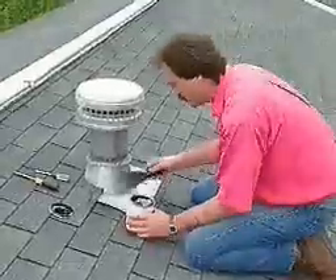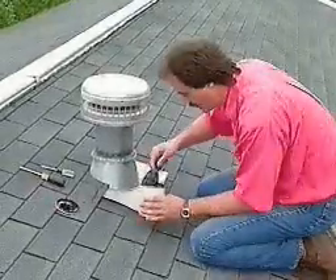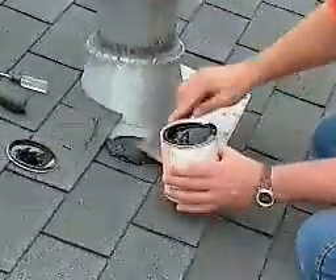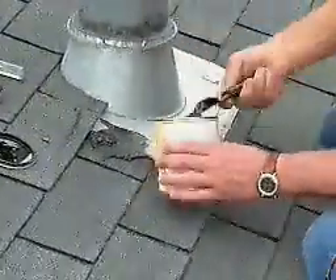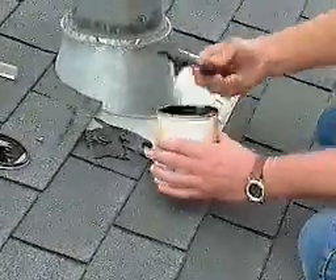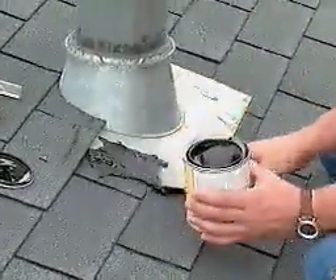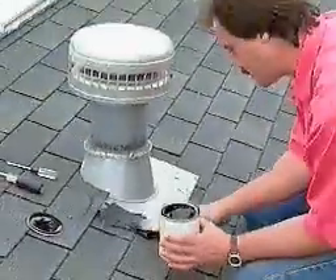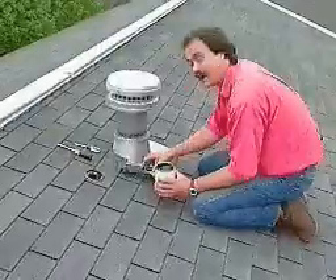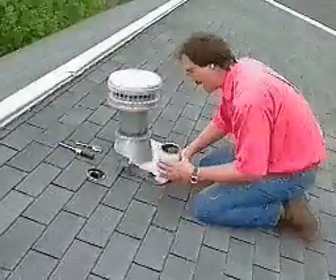Use a putty knife and coat it all the way around, nice and thick around the edges, making sure you're getting a full coat. Put plenty on there, build it up on both sides — on the shingle side as well as the aluminum side. Then feather it down nice and smooth, making sure that the angle is going to remain the same as the roof so that the water will run off of it. And you've got the leak repaired simply by using a patch right from the can.